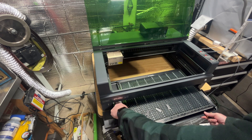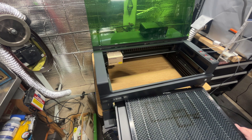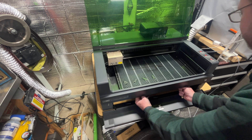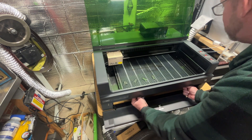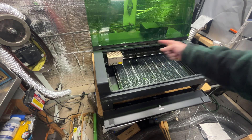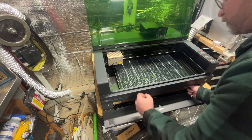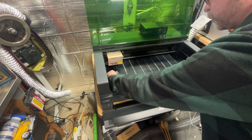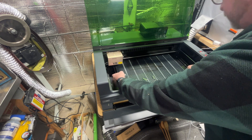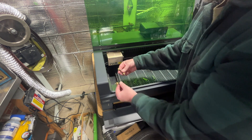You can see here's where the screws used to be, but you take them out and don't put them back in once you put the riser base back in, because the only place that uses them is the very top. Here's the problem — you can see without anything, you can have a lot of movement in this tray. This is a very fast laser, moving back and forth, and that little bit of movement can cause the tray to move around. So what I do is simply push the crumb tray up against this side nice and flush. For this one I just need the one and three-quarter inch size — two works perfect, one at each end of your honeycomb grid.